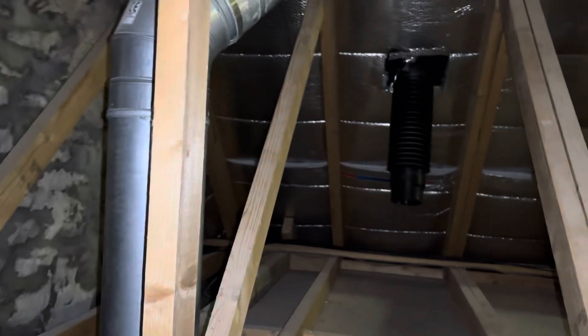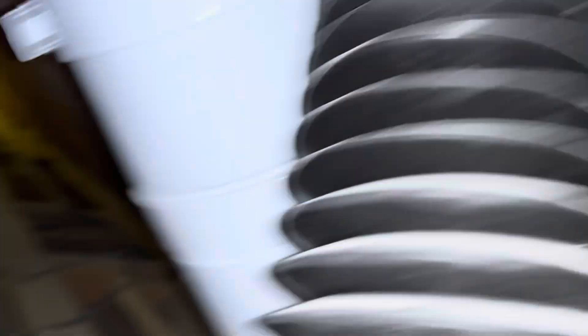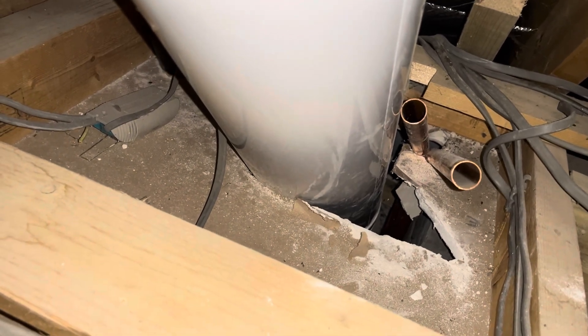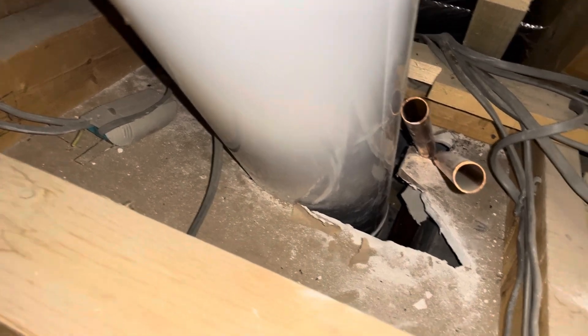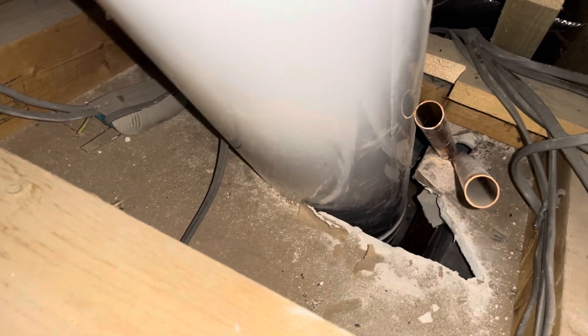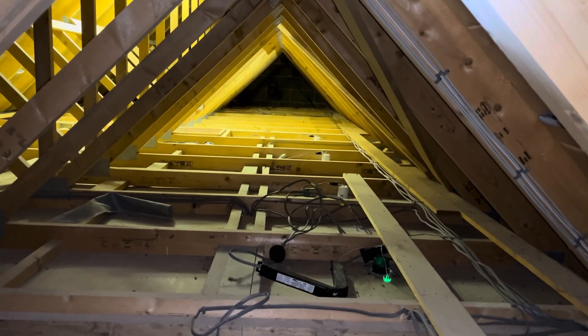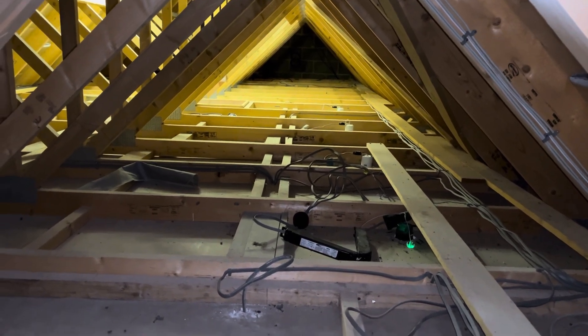I'm looking to see if I can install the system up here. I'm really fortunate I've got a vent to the roof there, also a vent here, and I've got these pipes that go down. One goes down to the kitchen, one goes to the boiler room and the central heating. I think this one's where I've got the most space — I cut out a little bit of plasterboard and I can see there's plenty of space to go down. These copper pipes go all the way down to the boiler room, so I should be able to fit the pipes down through there. I'll easily be able to put pipes along here to go into the bedrooms and get down to the fitted wardrobe and the lounge below without it being noticed.